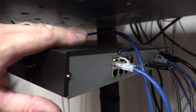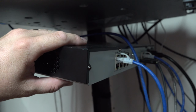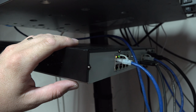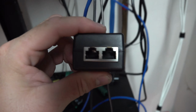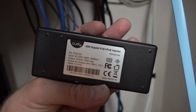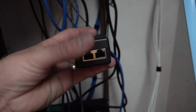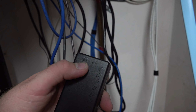Now, if you were not doing a setup with an NVR and you were using just the standard PoE camera setup, and we were actually doing a direct off the memory card recording, then you would have 2 ways of doing that. One, you could use a power injector. So this is just a cheap, what is the brand on this? Cuddy. And I'll put a link down in the description if you're interested in purchasing something like this. Just a 30-watt power injector. So if you look down, let's see, here we go. Data in, and then power and data out.